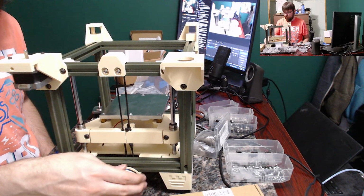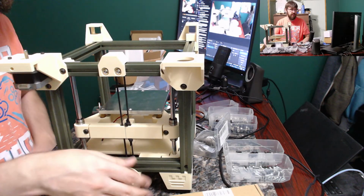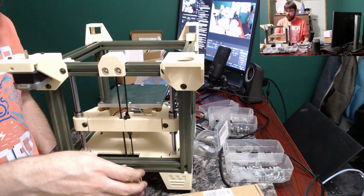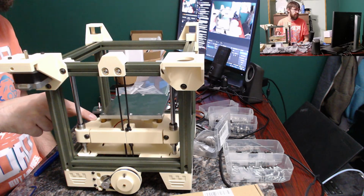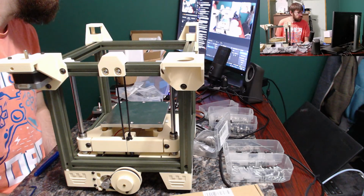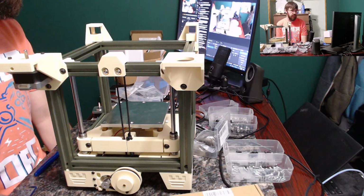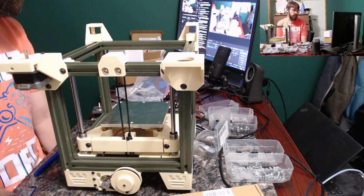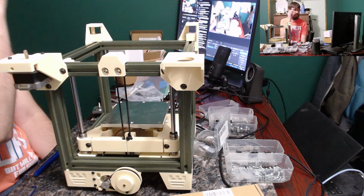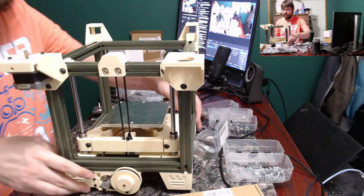piece. But with the V0 bed on here, this bed is already pretty heavy. So like this almost will fall on its own. Like it's almost to the point where it's just falling by itself, but yeah, you can easily set up a print end in your Klipper config so that when your print stops, it just lowers the bed all the way down to Z max. That's what I did. And then yeah, you don't have any bed drops.